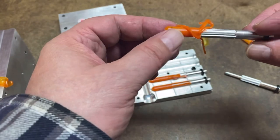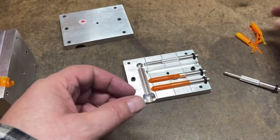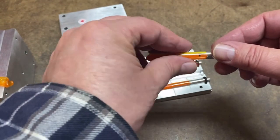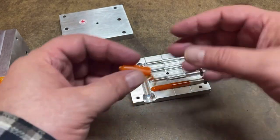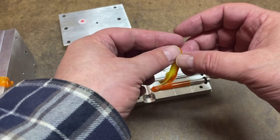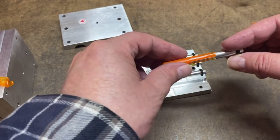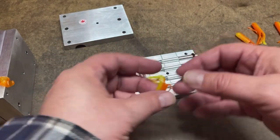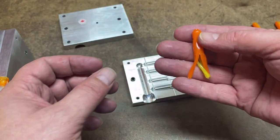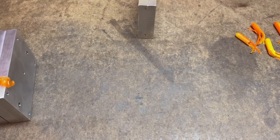You can rip those legs off too — probably not quite as easy. This color I call candy corn. Pulling those legs off — that's the sort of thing you learn when you're first working with molds; you learn all the little intricacies of how each bait type is just a little bit different. There we go — look, all the legs are there. What I did this time was hold pressure for just a little bit longer, not really more pressure, just a little bit more.